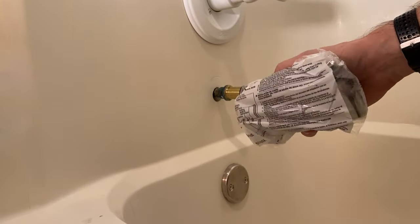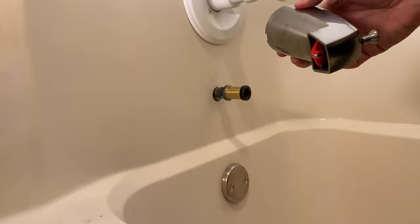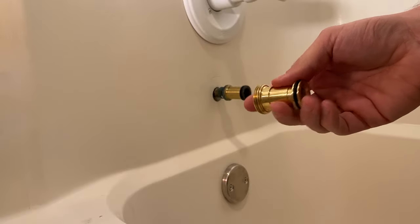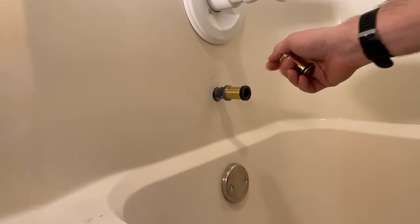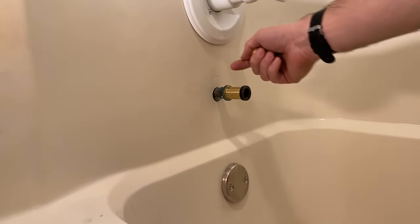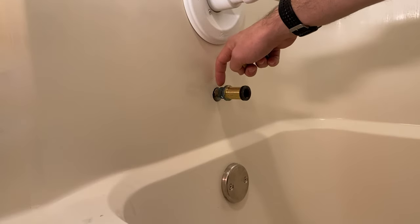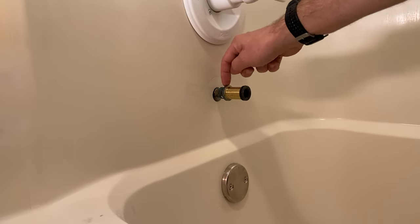So this component — just the spout's diverter — you can find it on Amazon; there will be a link in the description. They usually do come with that same adapter, so you might be in a situation where you need to install it. The challenge is if the copper pipe was coming out with a nipple on the end, it's not going to be at the correct distance, so you would have to cut the pipe. I think it's about half inch to an inch and a quarter between the wall and where this adapter would start, and you'd have to get the appropriate nipple. If this is not the type that you have, there are plenty of videos out there that will show you how to install this adapter.